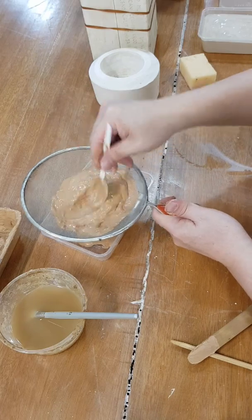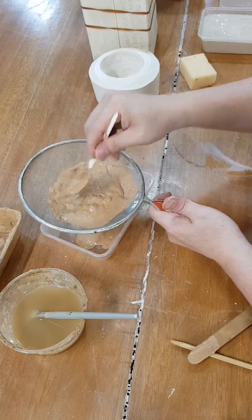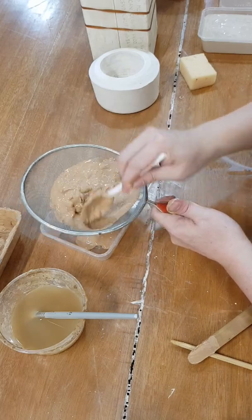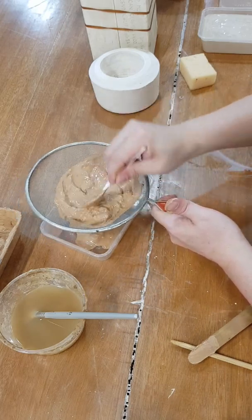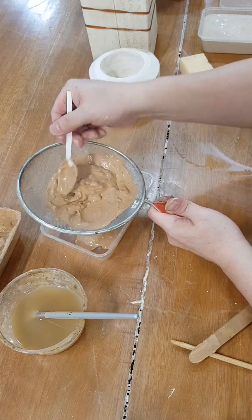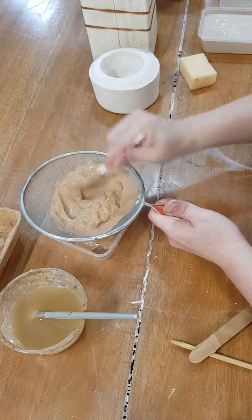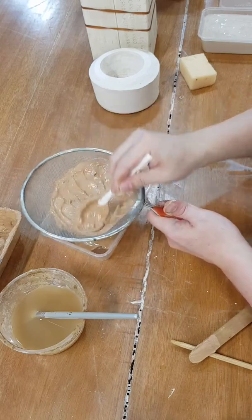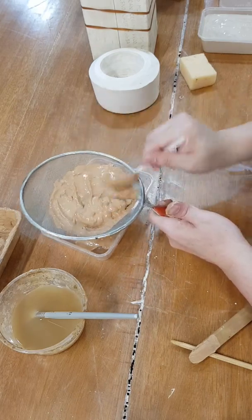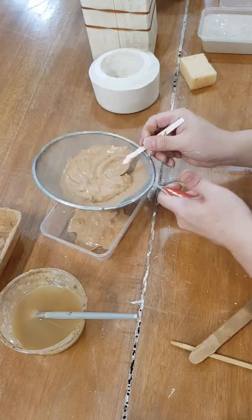it. Most industrial casting slip production, they usually look for clay that has a very small percentage of shrinkage. Okay, so they have less problem in casting the mold from its cracking and all that stuff. Clay in general, if it has a smaller amount of shrinkage, usually you have less problem from its shrinkage differences and not shrinking in a uniform manner. Okay, if it's not uniform manner, one part is shrinking, the other one is not, that is usually the cause of cracks and other imperfection.